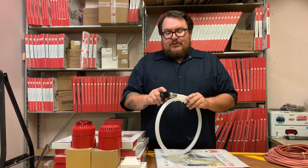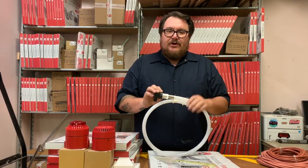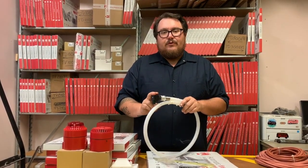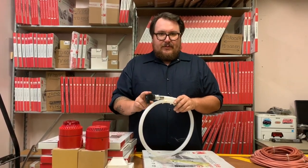So I'll tell you how the switch works. It's a pressure switch — when the unit drops below one bar pressure or is discharged, the switch will change poles. It's a two-pole switch with a normally open and a normally closed terminal, as well as the feed terminal and a ground.